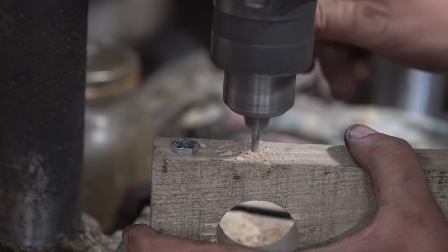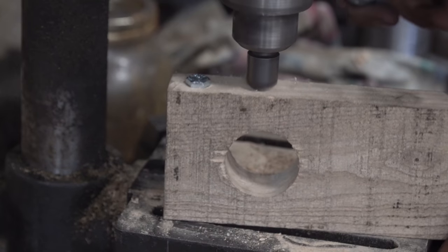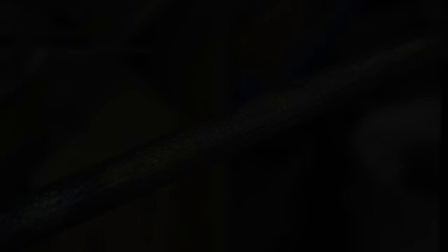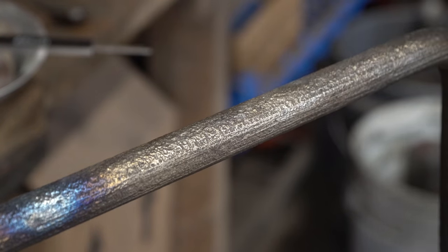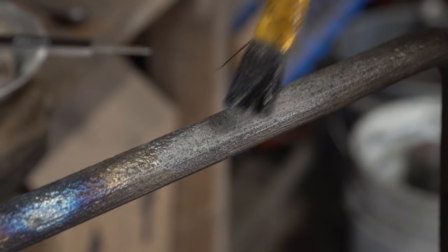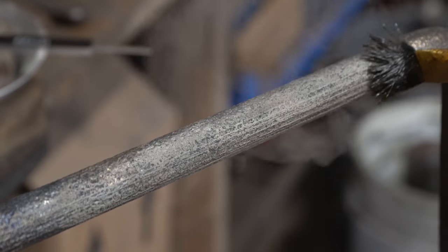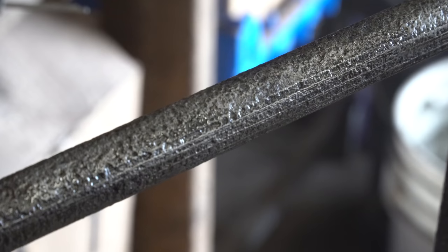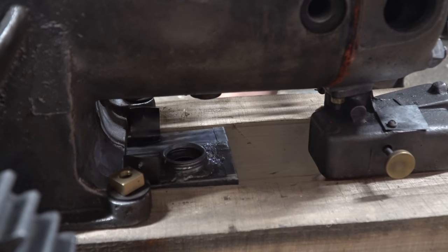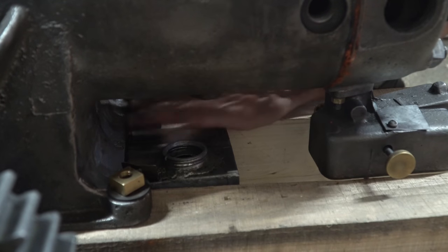I need to finally drill and countersink the oil holes. Originally I read that this was oil-soaked ash — and ash is somewhat similar in properties to elm, probably a better suited material, but elm will be completely fine. Here I noticed that this looked like wrought iron, and it is, so I'm brushing on hydrochloric acid onto this piece of steel. It will etch the surface of the wrought iron and give the grain a nice pop. That's for the arm that also attaches to the saw arm — the actual handle that a human holds onto.